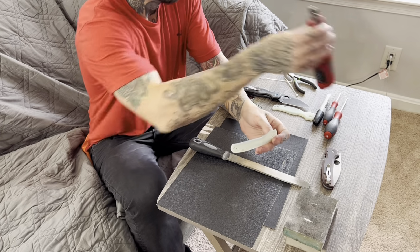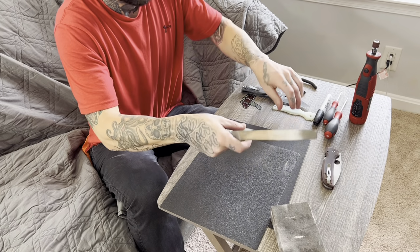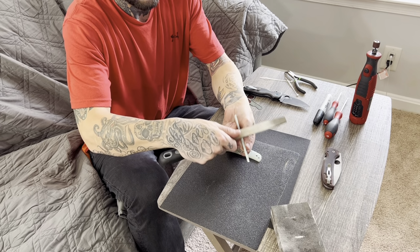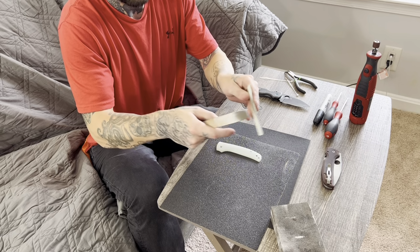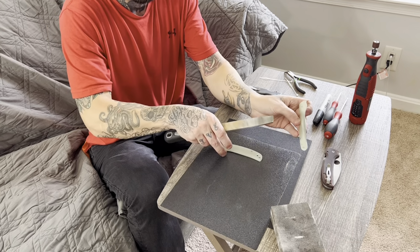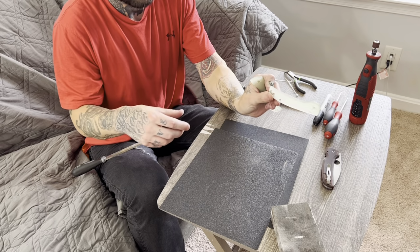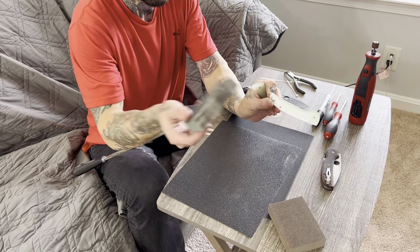versus using the file. This file right here makes it super, super easy. You just hold the scale in your hand like this, and you run back and forth across it like that, and that's gonna grind it down just in that hump until it is ground down to essentially what we have right here. And once the hump is ground down, then you're gonna wanna use the sandpaper or the sanding sponges